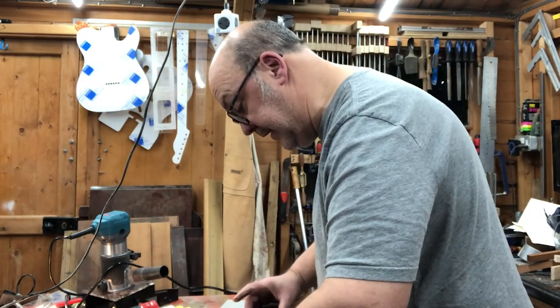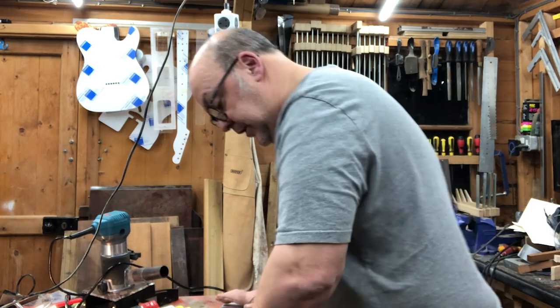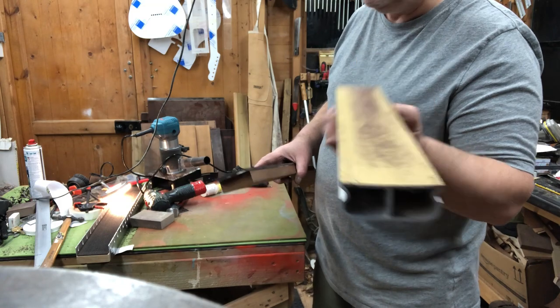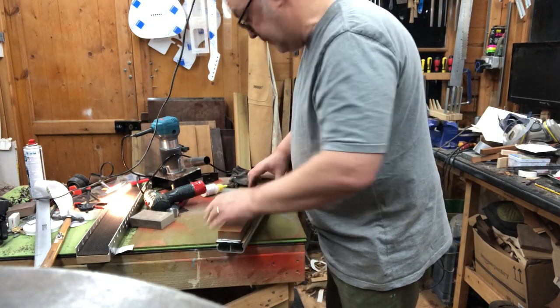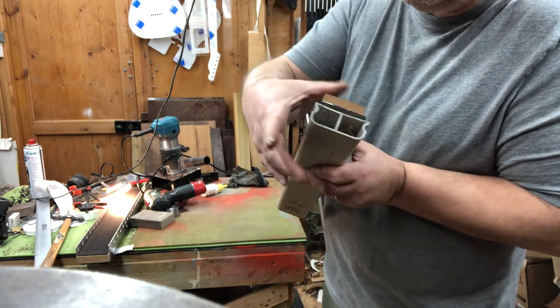Hopefully I can find these locating pins — wow, I went straight onto that one, and that one as well. Jeepers. This screws it together and it definitely feels located. I use the radiusing bar to glue with, because you've got an unusual curved shape here, but of course the radiusing bar is exactly the right shape. You stick it on top of the radiusing bar and that allows you to clamp it flat.